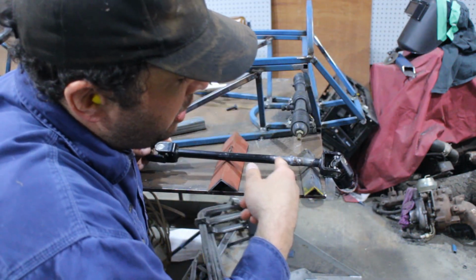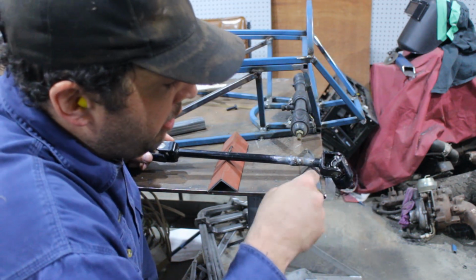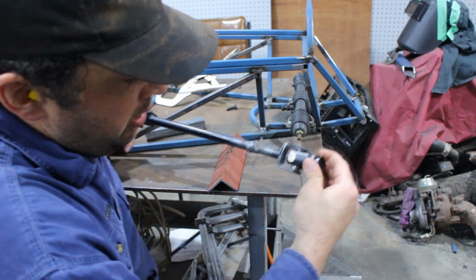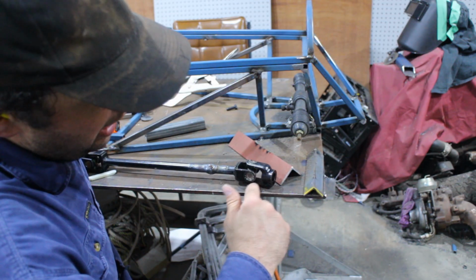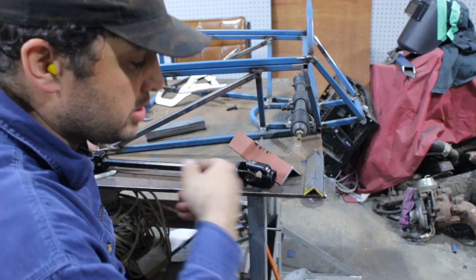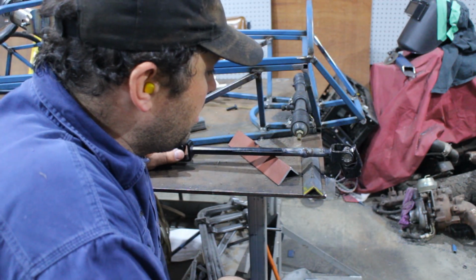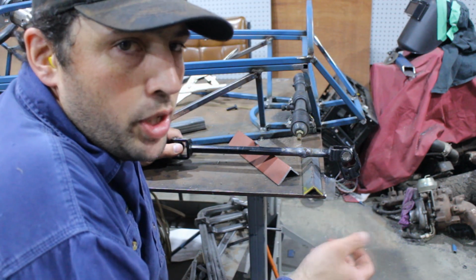Now I cooled it down because I don't want the heat to travel up and into the bearings, which is also why I had it sitting on the angles when I welded it, so it was arcing out through the shaft here, instead of, if it was sitting on the bench, it would have been arcing through the bearings, sending the electricity through the bearings to the weld, which would be a bad thing for the bearings. You should always try to avoid earthing through bolts and bearings,